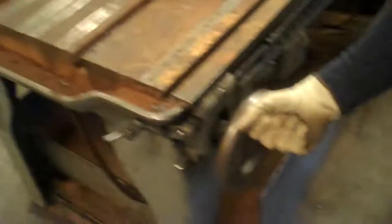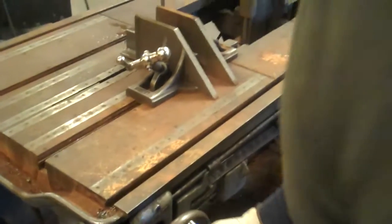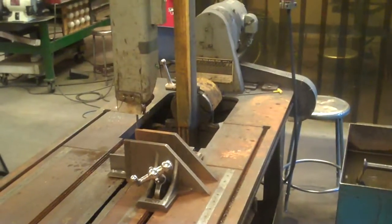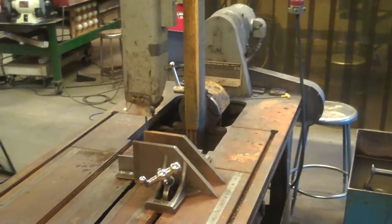Let's move to the other side here. This is the automatic variable speed gauge — it is set by this control over here. Use the owner's manual to find out how fast it should be set. The thicker the piece, the slower the motion you should use. If you go too fast, the saw blade is going to start to warp and the teeth are going to start to pull off.